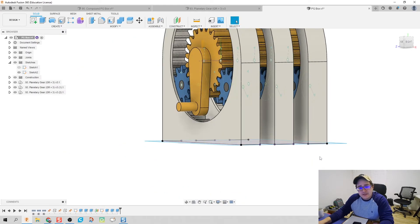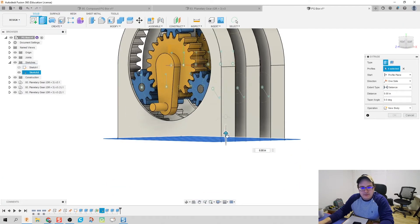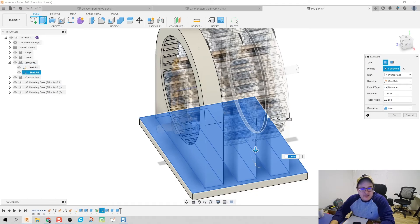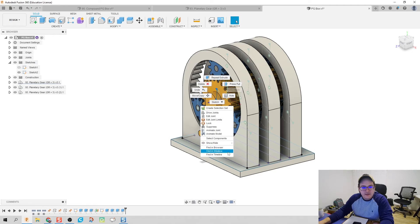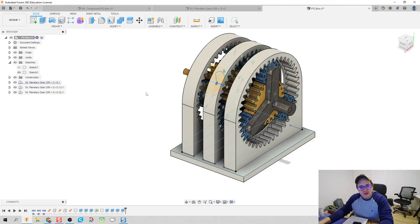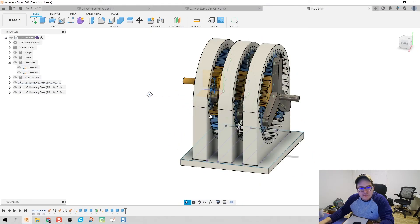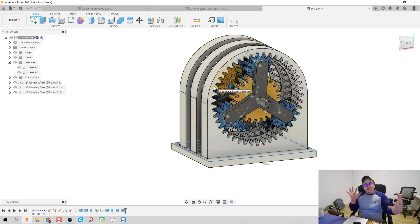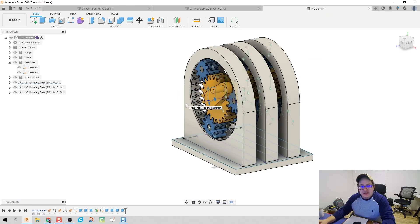Here's where I'm going to advise to not do a join — once we make our base plate and go down with it, a join would connect these three ring gear bodies together. Actually, let's just try it — worst case I have to restart. What happens if we did a join? Now these ring bodies are actually all one body. Does it mess up? No — and I thought it would. We have one ring body, everything looks good. I might throw some spacers in here and another face plate on this edge so it's fully encapsulated once assembled. There you go — we made a planetary gearbox with a handle and it looks great.